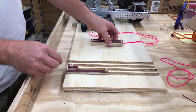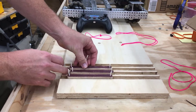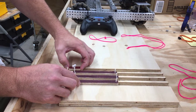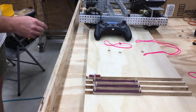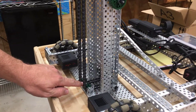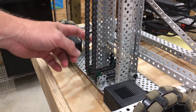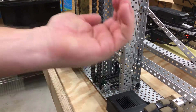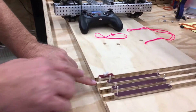Let's move to something slightly harder but fundamentally the same. Let's add in stages two, three, and four. I'm going to point out something you may have missed: on stages one, two, and three, there's an additional sprocket at the bottom attached to the chassis. The chain comes down, hits that sprocket, goes underneath all stages, and then back up on stage one.